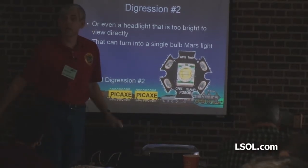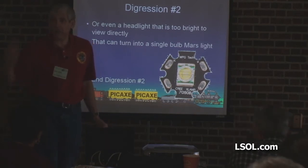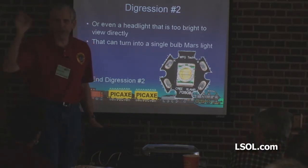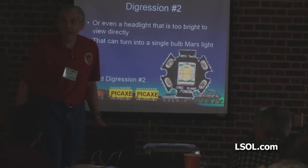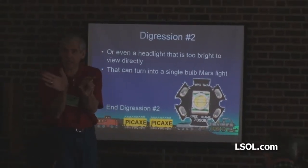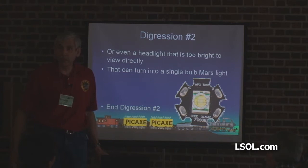Questions? Is that LED pointing out towards us or is it mounted up? The one in the engine or the lighthouse? They're aimed at you. Can you point them up until they're seen from all directions? No. It is not a multiple direction emitting device like a halogen bulb — it is directional. But could you take two of them and put them back to back? It has a pretty wide dispersion angle. I'm standing way to the side of that lighthouse and getting a good representation. I wouldn't use two — I'd use three. Then you see it from all directions.